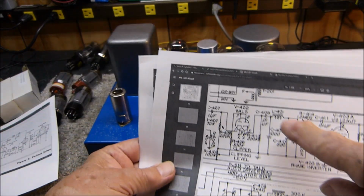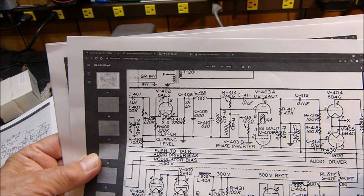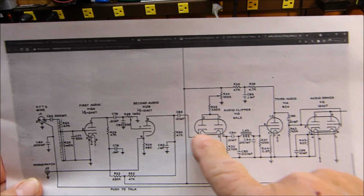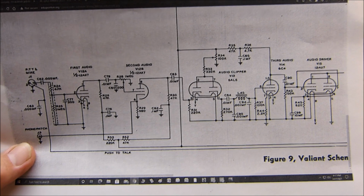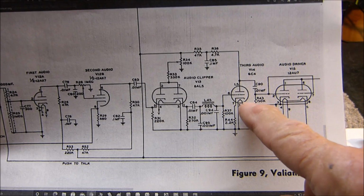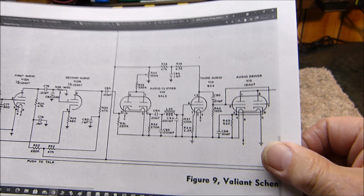But if you start studying this little circuit right here, this is the Collins KW-1, and then this low pass filter. If you study this really carefully for the Collins, and then you go look up the Johnson, this is the Johnson Valiant. If you study this circuit again right here, you'll see that they're like 99% the same. So you could build either one. Is one better than the other? Probably not. It uses 12AX7, 6AL5, uses 6C4, which is just half of a 12AU7. And it goes into another parallel 12AU7 because they're driving a transformer.